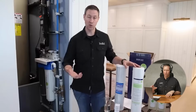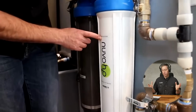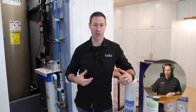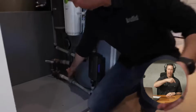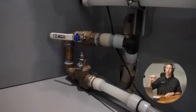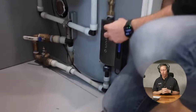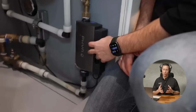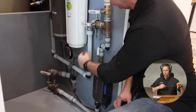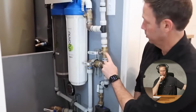So that tank that's behind me is a stainless steel holding tank. It's basically a big dumb tank. Not dumb. It's stainless, which is pretty awesome. It'll never rust. But all it's doing is holding the hot water. And then there's 2 1/2-inch Uponor PEX lines that run from that tank outdoors that are basically taking water from the cold part of the tank, which would be the bottom of the tank, taking it out to the outdoor unit, which is a heat pump, which, oh, by the way, is powered not with traditional Freon, but with CO2 as the refrigerant. That's pretty cool. And it's taking the heat out of the outdoor air, dumping into that water, and then using a small pump to bring it to the storage tank and dropping it in that storage tank, where then my house is pulling out of that storage tank.